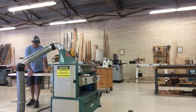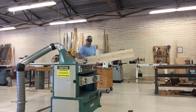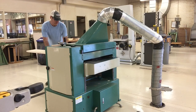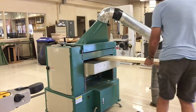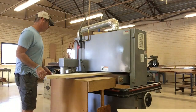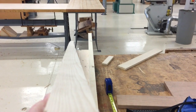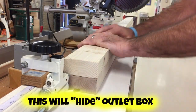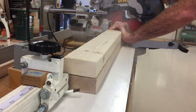Many of you probably don't have a planer, but since I do I went ahead and planed this down to really smooth it out. This is just a sander on steroids — if you have an orbital sander you can do the same thing. You can see how warped this piece of wood is. Now I'm going to start working on the rails, so I cut off the warped part and I'm now cutting these two pieces of wood down to length.